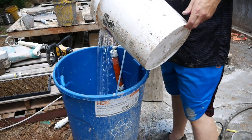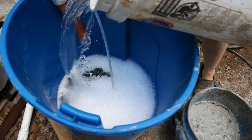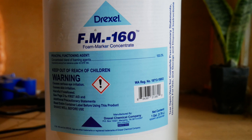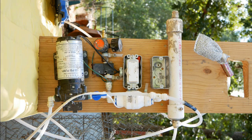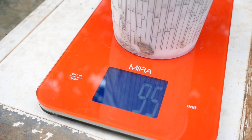Fill your container with a soapy solution — either 16 ounces per five-gallon bucket of 3x Dawn dish soap, but I highly recommend you buy the purpose-made Drexel foam agent. For a mix that works even for beginners, start with one ounce of Drexel foam to one gallon of water. Pump this through a 1.2-gallon-per-minute pump, then combine it with air from a regulator supplied by a compressor delivering 90 PSI at four cubic feet per minute. Adjust the air regulator to give yourself a 95-gram-per-quart batch of foam — not heavier and wetter, and especially not lighter and drier.